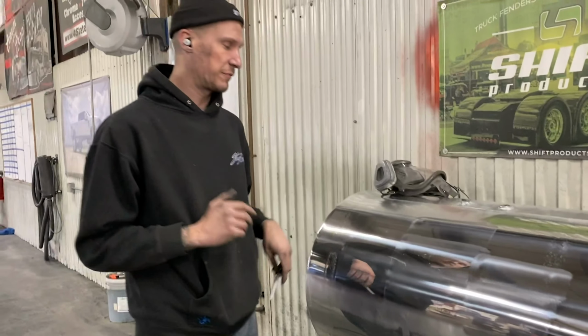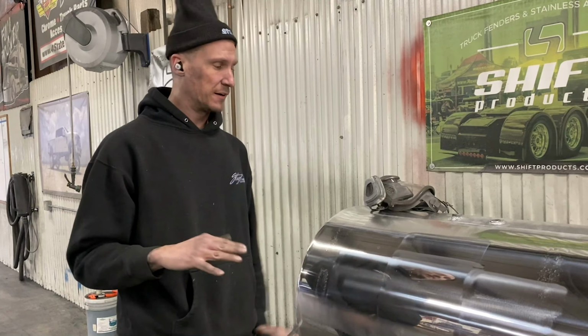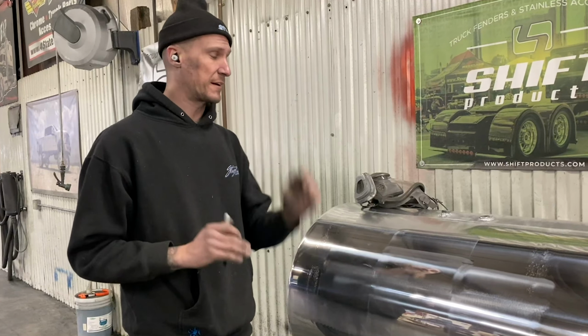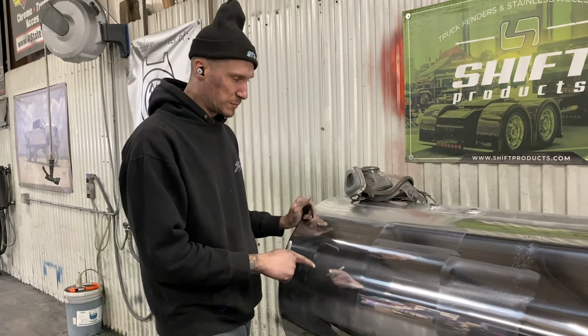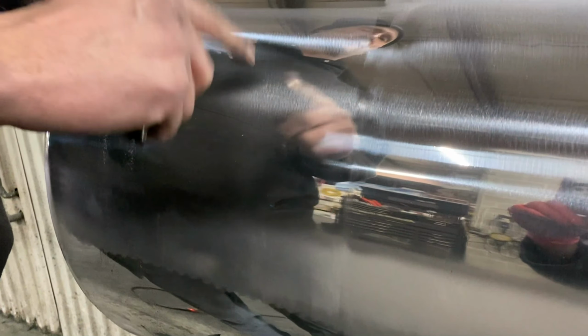I don't care if you use light pressure, medium pressure, or heavy pressure. It doesn't matter. As long as you're chasing your shine line, your pressure doesn't matter. As long as you stay within that, it doesn't matter. Now, if you zoom in close here, you'll see the light pressure always leaves less hash marks. So the lighter the pressure, the less hash marks you're gonna have.